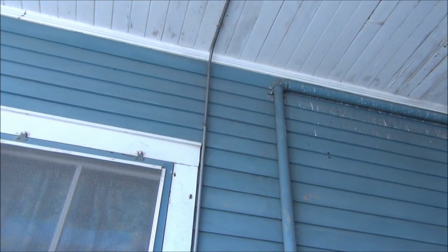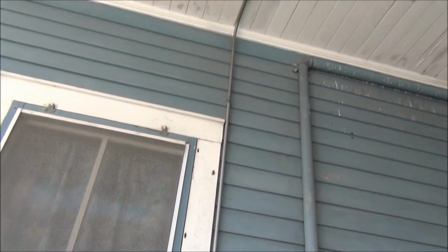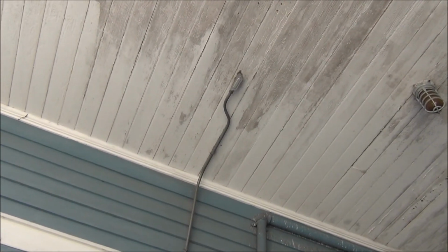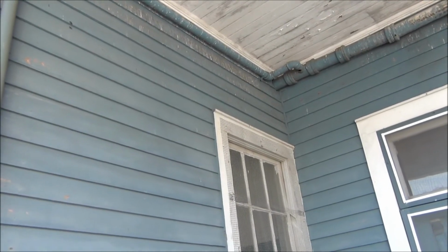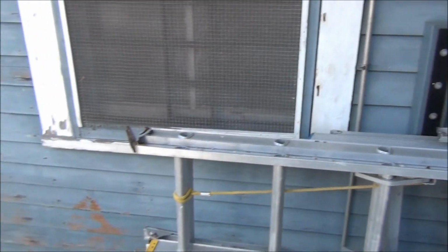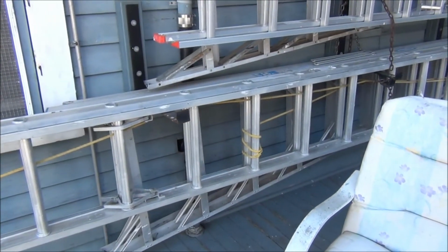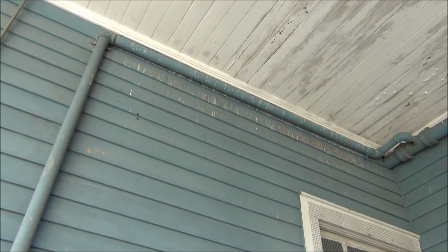Alright fellas, I'm downstairs. What's gonna happen here is these weatherboards are gonna have to be pulled off. You see how they ran the electrical? They went up the conduit and they went through there underneath and up into it. I'm gonna do the same thing, but with the other pipe. But to me that's ridiculous, so I'm gonna run it through the wall the way it should be done. When I do that, I'm gonna undo this electrical and run the electrical through the wall also to eliminate that pipe. So these weatherboards are gonna have to be pulled off, and all that's gonna have to be redone, especially on this side, the top over here, and this side over here, and then some of the bottom. But I'm gonna have to do that just to fix the problem. So we'll get that done and we'll see how that works.